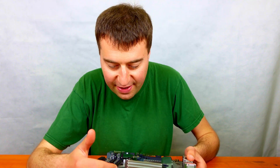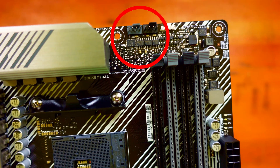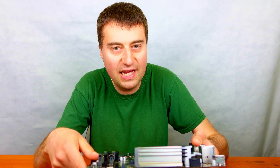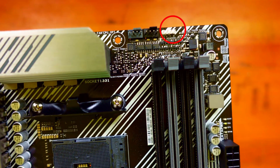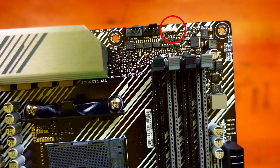At the top here we have two CPU fan headers — one CPU fan and one CPU fan optional. That means if you've got an AIO pump you could use both headers there, but you could also use that as an additional fan header if you wanted to. We then have the 12-volt RGB connector, which is handy if you are running older-style system RGB.